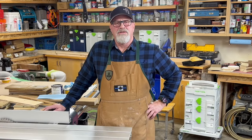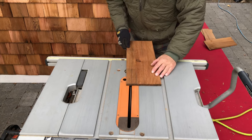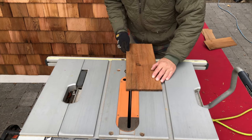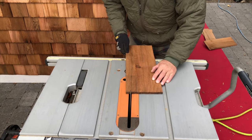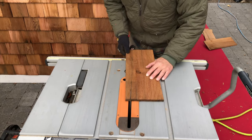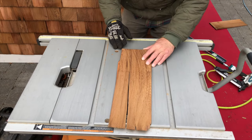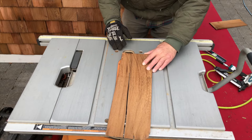In the case of cutting the cedar shingle on the table saw, you saw the kickback that occurred. I didn't get the one that injured me on film. The saw blade was a little bit too high and I was trying to make too drastic of a turn cutting freehand with the table saw. That table saw grabbed the material and shot it back, smacked my left hand so hard it was very painful. You can see the black fingernail — and that was almost a month ago and I still have it.